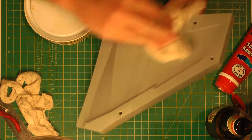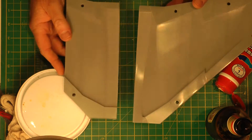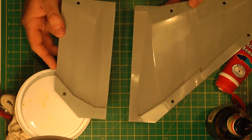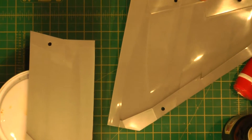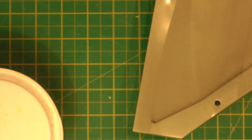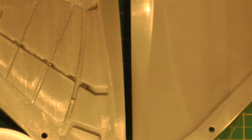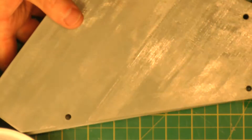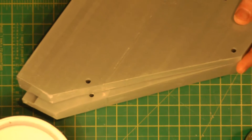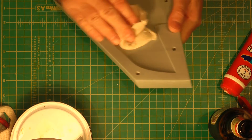As you can see it's come out pretty darn good. That's what we basically started with. This is going to be for the top — let me zoom in a bit. This is going to be the top part, and then we've got the core part for the skin here, which is going to form the skin. So I'm going to stick a couple of coats of wax on this now, and then make a start on the cores.